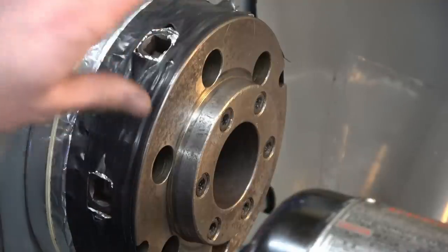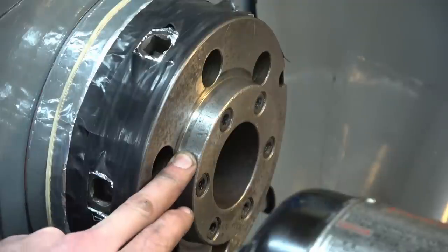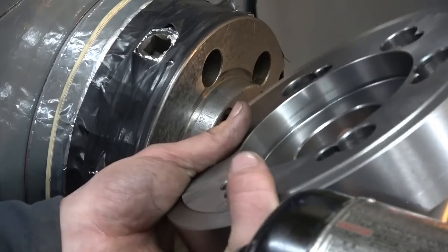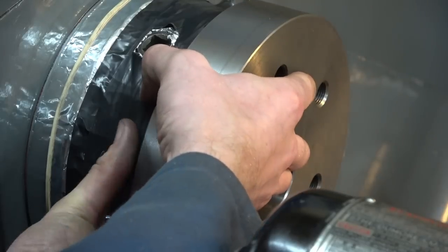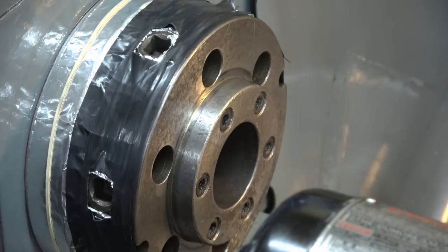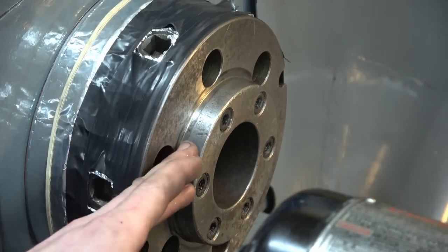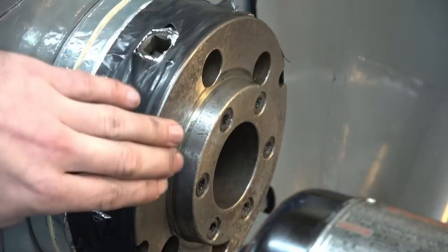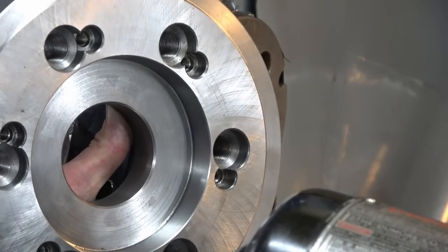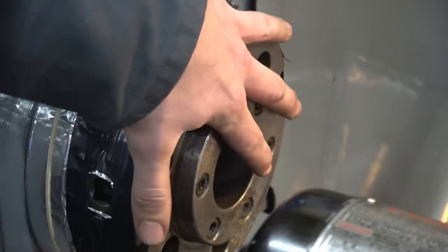Allow me to introduce you to my spindle nose. He's very well behaved, however he does suffer somewhat from cosmetic appearance and high spots. This spindle nose has clearly had a very hard life, and all these little marks have probably been caused by swarf being left in the gap between the corresponding faces when everything is tightened up. But this happens to be brand new and has no marks in it — getting swarf stuck in these joints affects both surfaces. A D16 spindle nose arrangement happens to be a dual surface design, so both the taper and the face are used to align and secure the work-holding devices to the spindle.